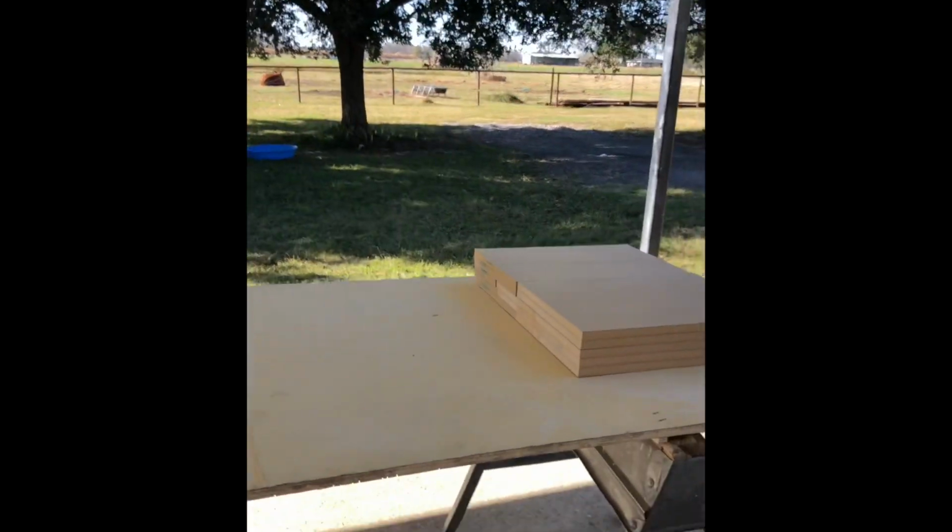So we have to take all that material out, and no matter how strong your router table is, you can't do it all in one pass, because it's just taking out so much. It'll actually flip the breaker on the outlet that you're using. So what we do is we take them down, like, I want to say 3 or 4 steps. It all depends on how the router table's cutting that day and how sharp our blade is. But most of the time, and I don't know if this is just a luck thing or what, we'll be on the fourth pass, last piece, and what do you know, boom, it chips one of them. You gotta start recutting pieces and resetting the table, and it's just a heap of shit.